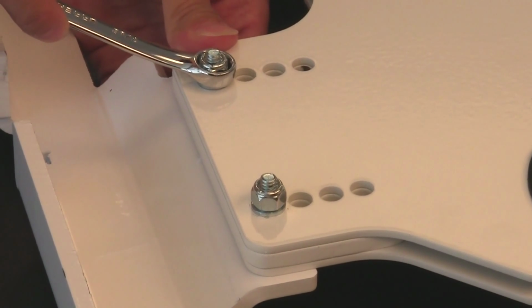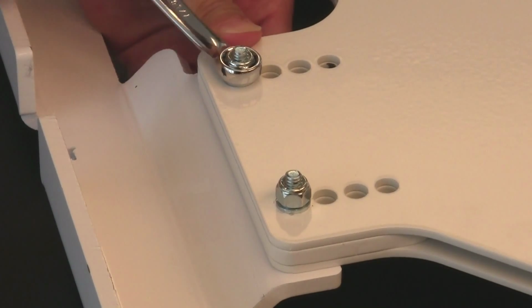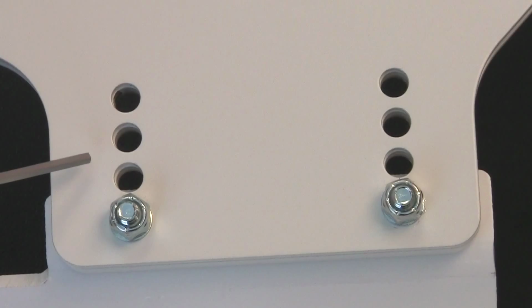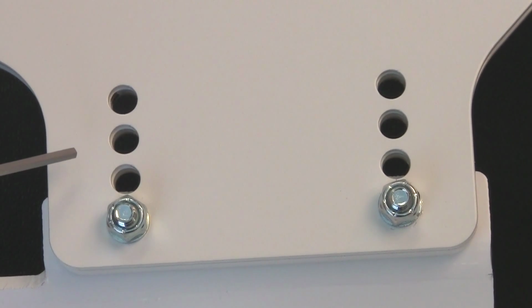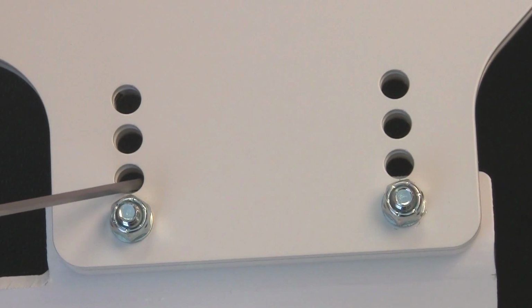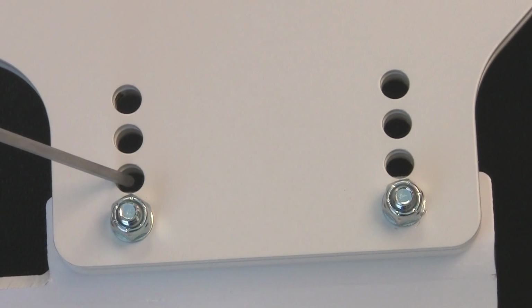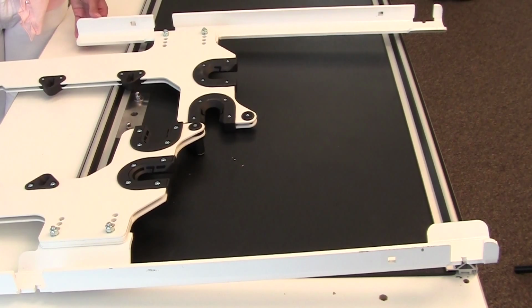Pushing the bolt head up into the base so it won't turn, tighten the lock nut with a 7/16 inch wrench not provided. Using the holes as a guide, with the top edge of the base, visually level the pole bracket assembly and fully tighten the carriage bolts. Repeat this process on the left side.